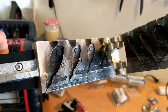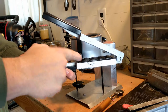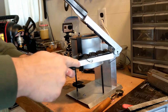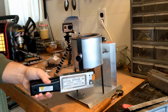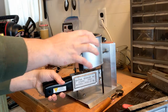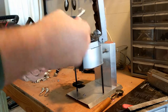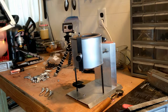So the first step is to put your hook down in the opening. I'm going to pour a one-ounce Spro head with a 4/0 hook - I usually do four or five at a time. You line it up right into that channel, close the mold, slide it into the little holder, and lift the handle. Just like that, it's filled. Let it sit level until it hardens, then lift it right out. Pretty much repeat that a couple hundred times.